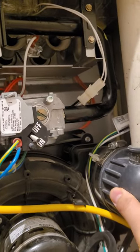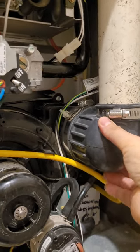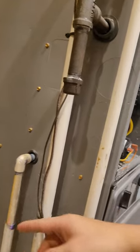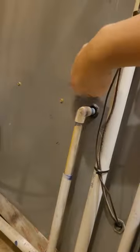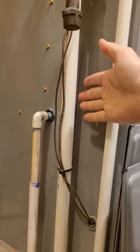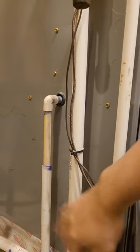If it turns off in three, four, or five minutes — it does run for a little bit but doesn't reach your target temperature — it's definitely the water. Another thing you have to be mindful of is this runoff tube. This is where the condensation accumulates and comes down from the tubes. It's supposed to drain out here, coming out from the side of the unit. It carries drainage from a lot of these pipes from various sections of the house.